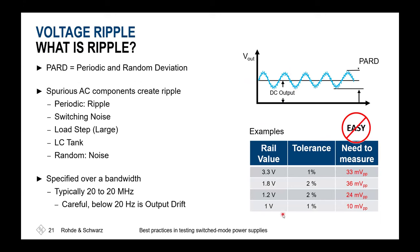If we think about today's electronic systems, there's only one trend that is quite obvious. More or less each of the active components we'd like to power up has its own preferred voltage. This does not necessarily have to be 1 volt. It could be even 300 millivolts, 500 millivolts, you name it. And thus the tolerances, if you take them into account, lead to a really low voltage value that can be tolerated by the input of these active devices.